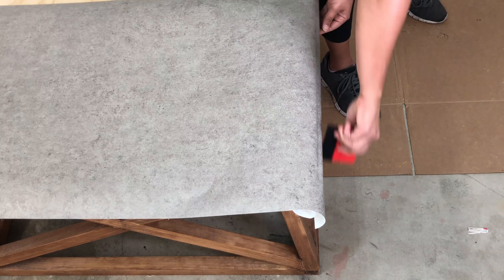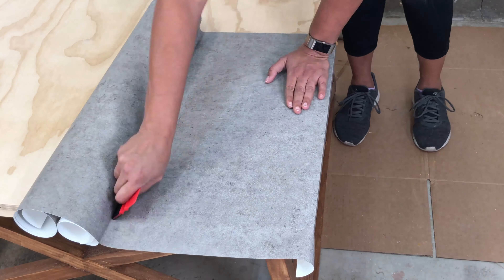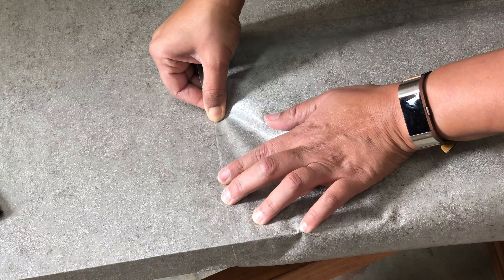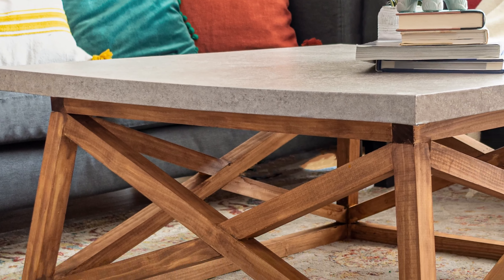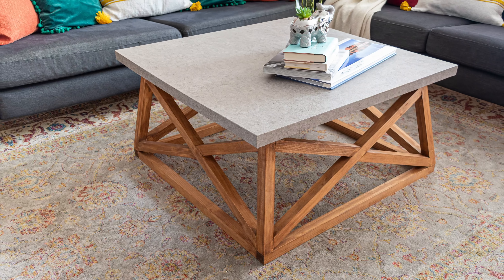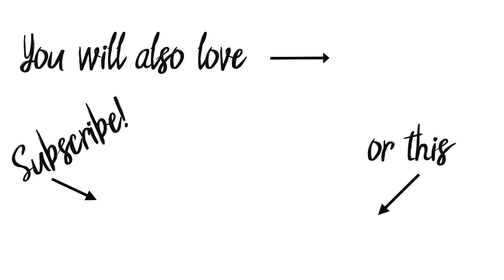Because I am emulating my inspiration piece, I am going to use contact paper. The important thing when using contact paper is to make sure that the surface is clean, so I sanded it down, wiped it with a damp rag, and then used a vacuum on the entire surface for good measure. Then I went ahead and applied the contact paper. I have a full video showing how to do this, including how to make those corners, linked in the description below.